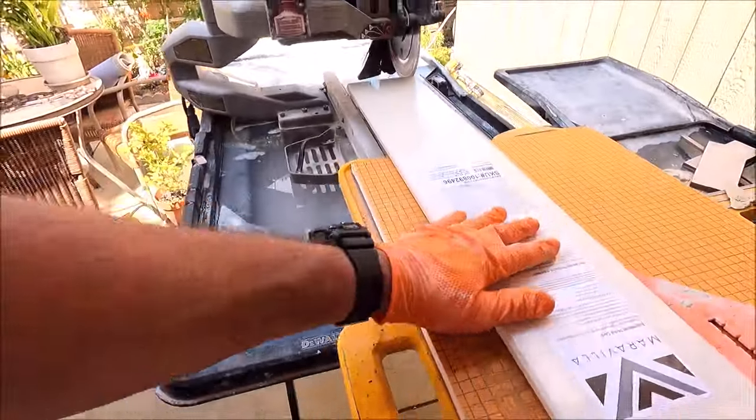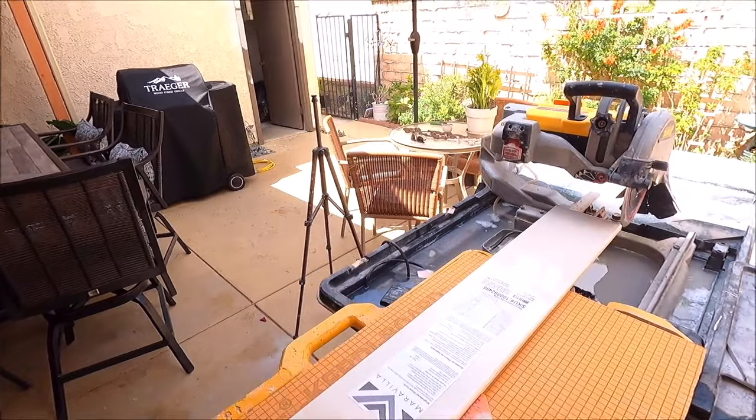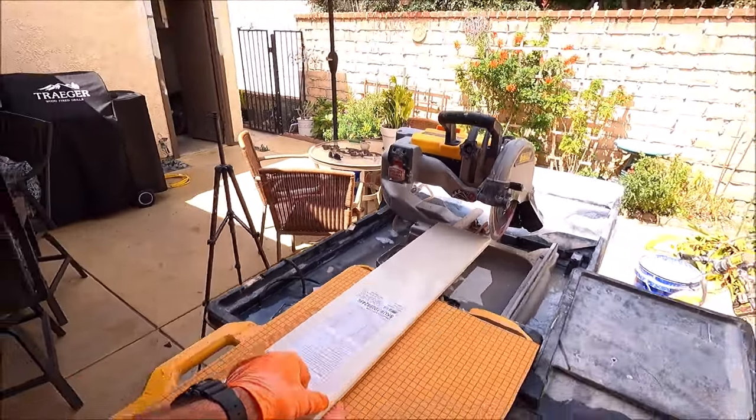Cutting all of the sills, the cap for the pony wall, the cap for the curb, as well as the niche sill using our quartz. Quick little trick: half inch foam board if you have this length to make the cut super simple, and then you use a square to make sure you square it off. Basically we need to cut off this beveled edge here.